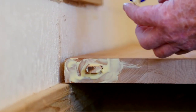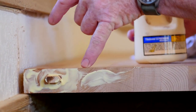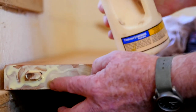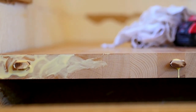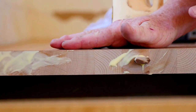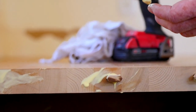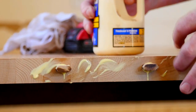Like we did on our previous video, we're using the domino system and I'll be putting in the dominoes, gluing them in. Then we'll have our assistants bring over the other part of the countertop, glue it in, and I'll show you how to clamp it up. I do glue these in on both ends. On this particular piece, we don't have to worry about glue out in the center as much because that's going to get cut out when we cut the sink out. Use enough glue to make sure the whole surface is covered — any spot with no glue is the spot that won't stick. It's important to have an even coat. If you use too much, it'll scrape or sand off. If glue gets on the top surface, just let it dry and then scrape it off — if you try to wipe it with a rag, you'll rub it into the grain and it'll show under polyurethane or butcher block oil.